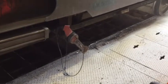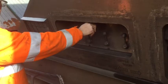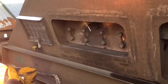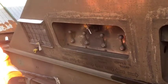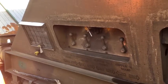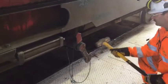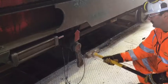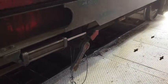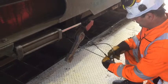The operator now has to open the door panel on the secondary locks. The reason for opening the door as shown is to help the air system — once the operator has started to tap the flogging spanner, the air will actually take over and then put it into the open position. The operator can start tapping the flogging spanner to allow the secondary lock to come over, and as we can see the air system has now taken over. Once the secondary lock has come over, the operator can take the flogging spanner off.